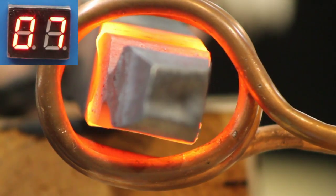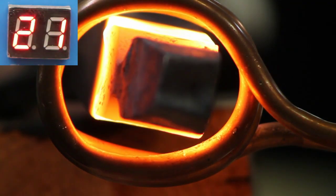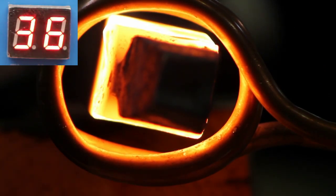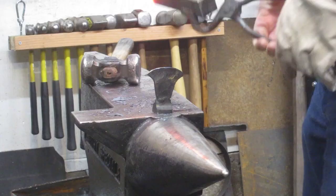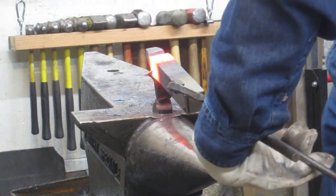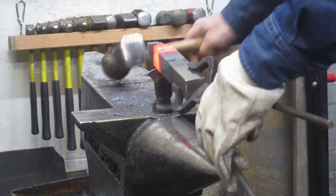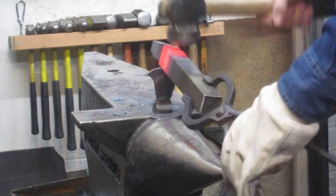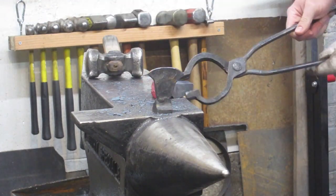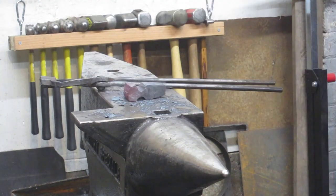Another good heat and we should be able to get it through. I'm cutting it from two sides because that's going to leave the marks mostly right for the way I'm going to spread the metal. I'm going to get nearly through and then cut it sort of lengthwise. You can see it's starting to flop a little bit, so I'm getting close. Now I'm going for that lengthwise cut to cut that final membrane out. Coming out really quick and we're just about done. There we go. Let's get the tool off the anvil so there's no mistake.